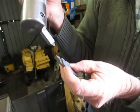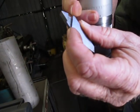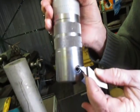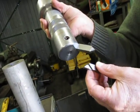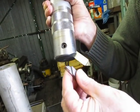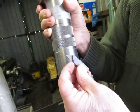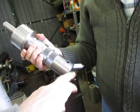These tools which fit up inside the boring head have got an attachment in the end to allow it so that when you turn this dial, this tool is accurately brought in or out. That's a larger diameter, so you have a larger tool of course, but this is for a smaller one — you can see where they do engage and they do slide up and down. Then you would probably do a positive lock with that.